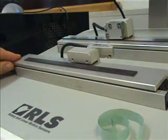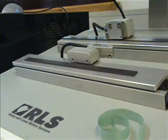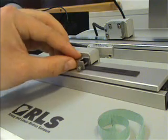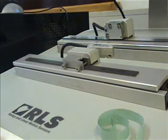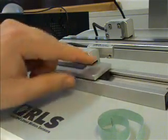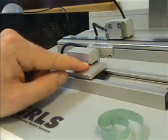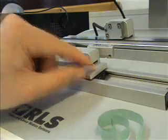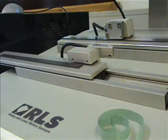A second operation can also take place now to install the cover strip. This can be done by reinstalling the applicator tool and threading through the cover strip in exactly the same way. We recommend that the cover strip extends past the end of the scale, and can either be secured down by a screw or by the double-sided adhesive that's provided.